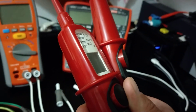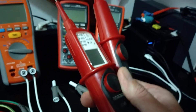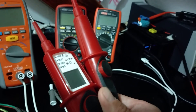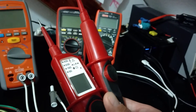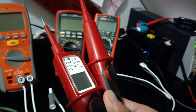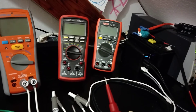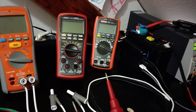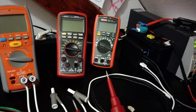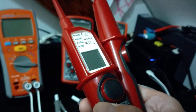But what is a good use for non-contact voltage? For example, just imagine you have an electrical installation — a ton of circuits, not uncommon to have a home where you have 15 to 20 different electrical circuits — and a thick mass of cables comes out of a wall in the basement and leaves through the other wall, and you want to find the junction point of one of them. How to find out which cable is which? Obviously, quite frequently it's not properly labeled, so there is no means to distinguish 20 gray cables. That is where non-contact voltage is really useful. You switch all the circuits off except the one you want to find, and then you probe them one after the other and mark the one with the highest signal.